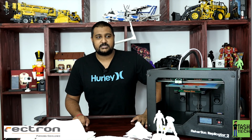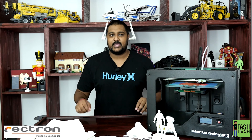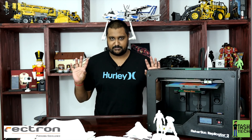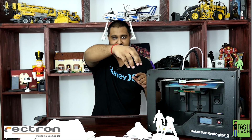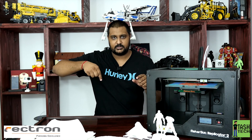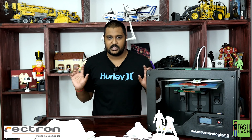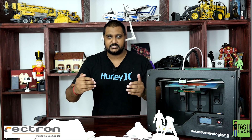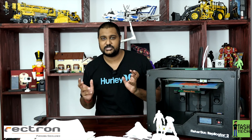The 5th generation is something I haven't seen before — it's pretty interesting and immediately when I started printing I was flabbergasted by the design. It has two motors that sit at the back of it and a belt that goes around the entire printer. A bearing sits on the top right, comes back and goes onto the X carriage, and then the same from the other side, and they both tether at the extruder carriage, the hot end. It's so cleverly designed because if they both move in tandem the belt tensions and it moves forward or backwards, and if one moves a little bit slower it moves the other direction.